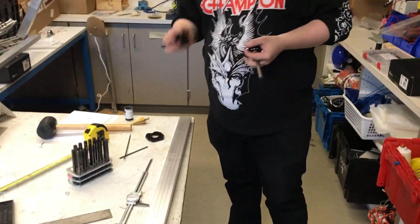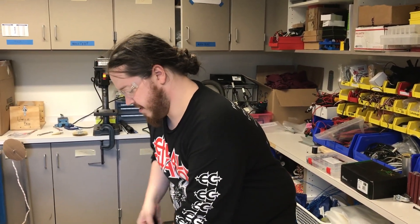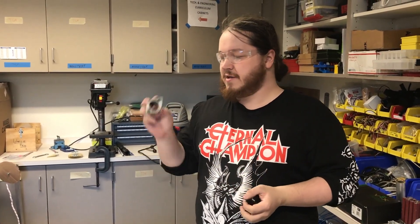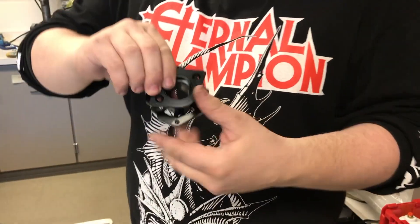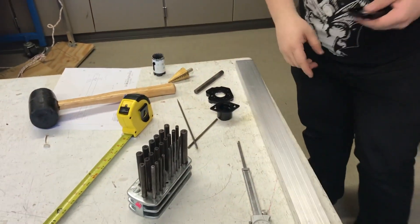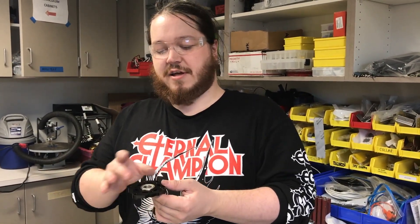The last hole is the one we're going to use for our West Coast Products Transmission, so we have to use this output block. This hole has to be precision — it has to be the right size, you can't slide this. It would be hard to transfer this onto there, but there's a nice easy way to do it because it matches the geometry of your VersaBlock — the holes line up nice and easy. We can actually use the VersaBlock to make this. Unlike the last ones where I didn't care about top and bottom of my VersaBlock, I do need to know the direction because this is a sixteenth-inch offset for your drop center on your VersaBlocks.